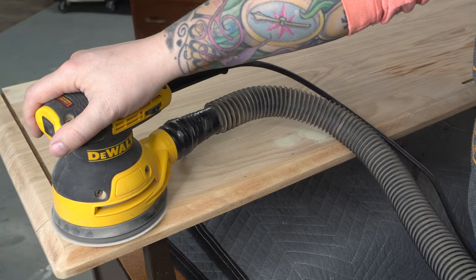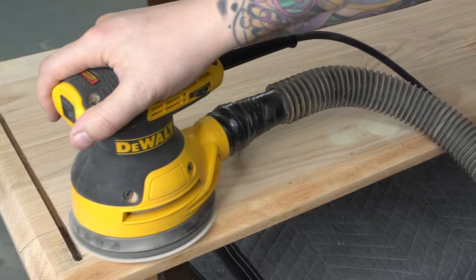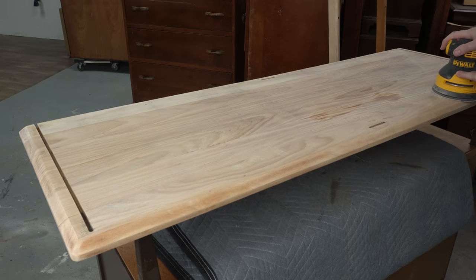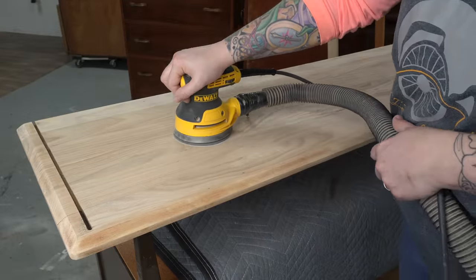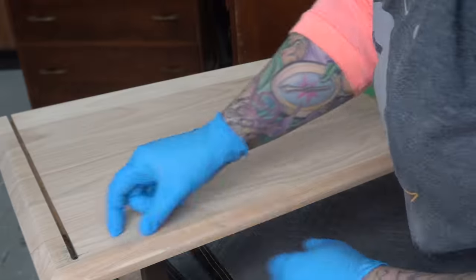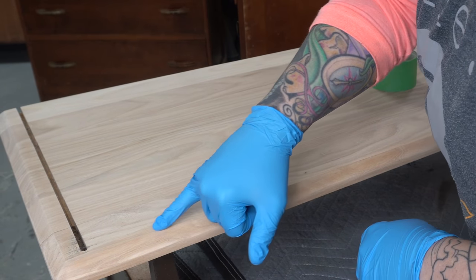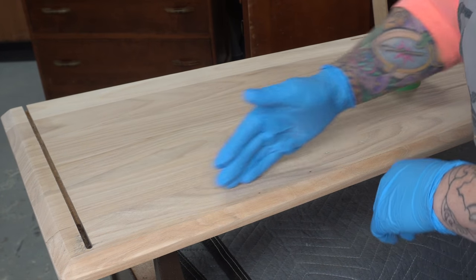It's time now to go back in and finish sanding the base — I initially sanded with 150, then 180, and then I'm going to go up to 220 and that's where I'll stop. Part of this piece of wood is going to be inside the cabinet and the other part will be exposed around the outside, and these two areas are going to be different colors. So I want to make a line here so that I can stain the inside part with a darker stain.